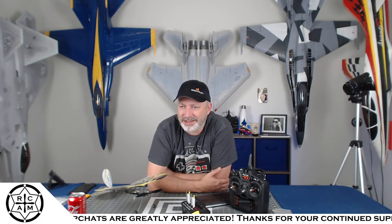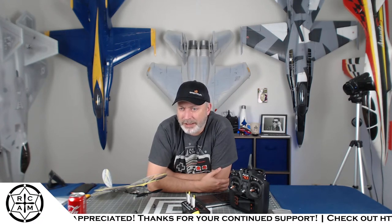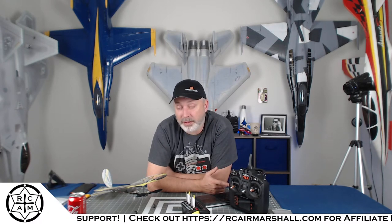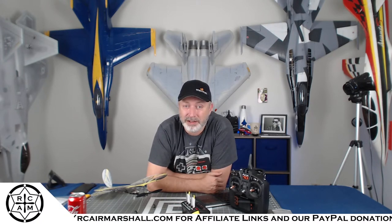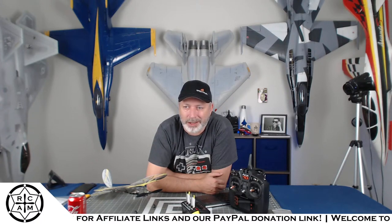Can you charge the NX10 with a Gen 2 smart charger? Yes. So the NX10 charges from a USB cable. All of the NX series charge from a USB cable. And the Gen 2 smart chargers have a 2 amp, 5 volt USB output on them. So yes, you can absolutely do that.